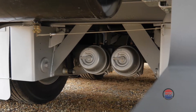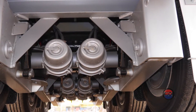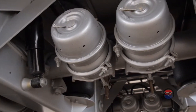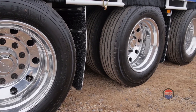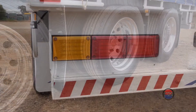Axles are standard GP 73 inch wide, 5 inch round with 16mm wall thickness, 285 PCD 10 stud, grease hubs with 16.5 by 7 inch brakes with quick release shoes, steel drums and 30-30 boosters, polished alloy wheels with 275/70R 22.5 TR656 tyres in a standard trailer pattern. Try saying that with a mouthful of marbles.